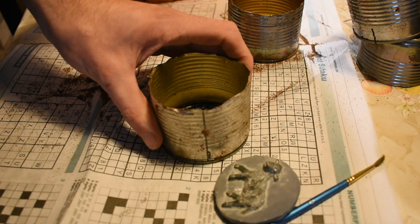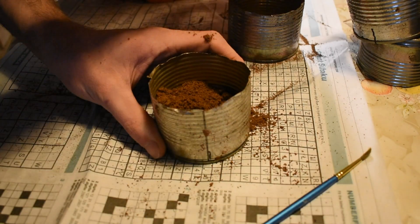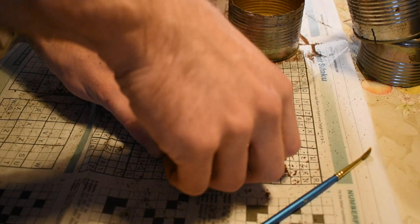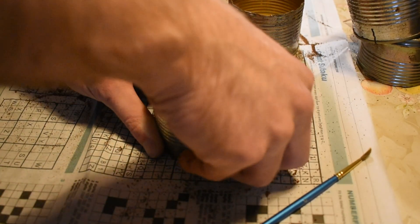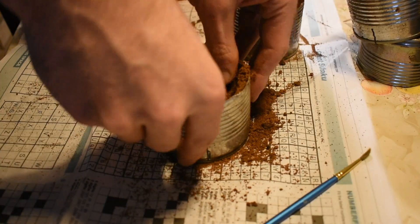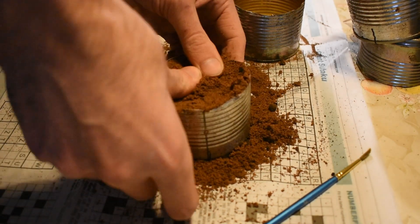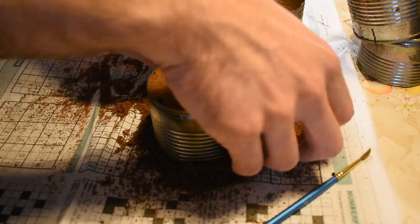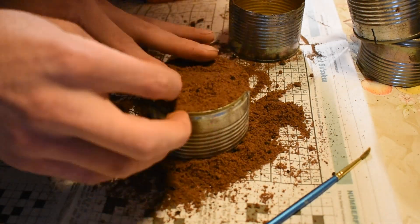You then take the piece of the can which has the inside lip and start filling that one up first. Put a little bit of sand and start pressing it in. You want to use the inside lip first because if you used the outside lip you wouldn't be able to place the tin cans together when making your mould. Fill it up and press down firmly on a flat surface so that you get a nice flat finish on the top. You can put a little bit more sand around the edges, as the lip stops the sand from going into those sections when filling up.